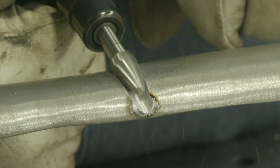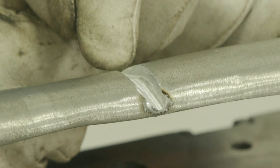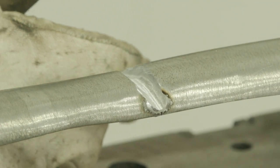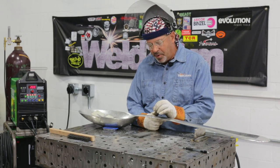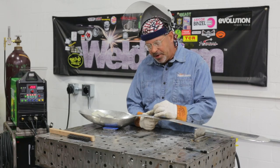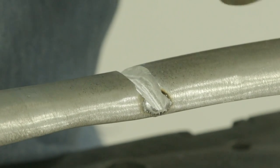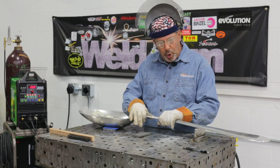I've opened this up with the carbide burr, and I want to kind of start into this tack. I've left the tack on there a little bit, and I want to come in here and fill this and get down inside there quite a ways. I think I was putting a little too much pressure trying to go into it, and that's where I was getting the chatter. The carbide burrs work best if you're just wiping them — that way it doesn't load up on the flute of the carbide burr, and I was able to chip and cut this fairly quickly. So I'm going to weld this part of it, leave the weld alone, turn it over, and back bevel the other side and try to get some good mass down inside this throat of this weld — this spoon, baby spoon.